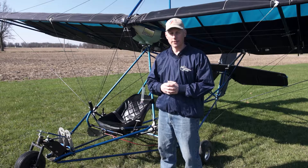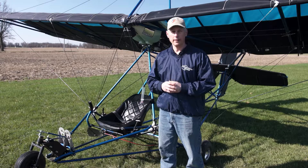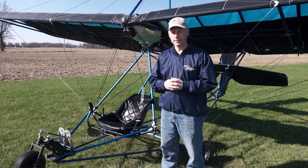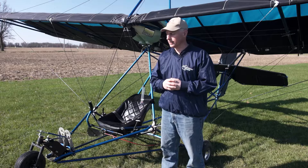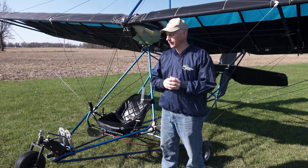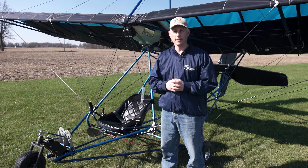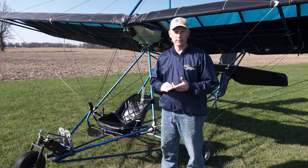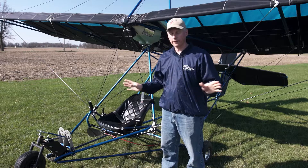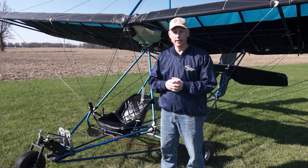If you're not familiar with ultralights, let me talk about Part 103 of the Federal Aircraft Regulations. Part 103 is what covers ultralights. Basically, an ultralight is 254 pounds or under — that's your maximum empty weight with no fuel or pilot. There's no horsepower limitation. You do have a 5-gallon fuel capacity maximum. And we can't have a speed higher than 60 miles per hour, full power, straight and level, and the stall speed has to be 25 or under. This aircraft meets all that criteria. I think you'll find it's probably the best ultralight kit out there right now, at least in my opinion.